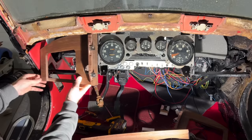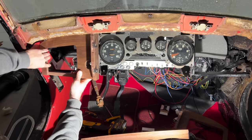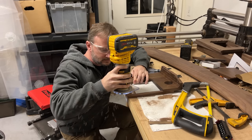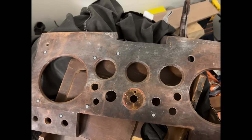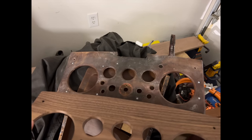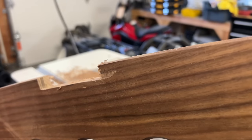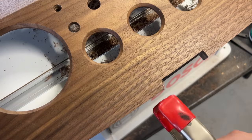I added kick panels back when I did the door cards with foam underneath so the vinyl would have a nice plush look, but this interferes with the glove boxes, so I had to trim off some of the sides using those flush router bit cutty things — a smaller bearing to cut off a sixteenth of an inch at a time, a few passes, and it fit great. I also needed to trim the wood covering the gauges. I thought the cutout was bigger than needed, but it actually does need to be that big because of the way it has to be installed. I did that on the router table — not the correct way to use it probably, but it worked. It chunked off a bit of wood, but I found the piece and glued it back on, and nobody will ever know.